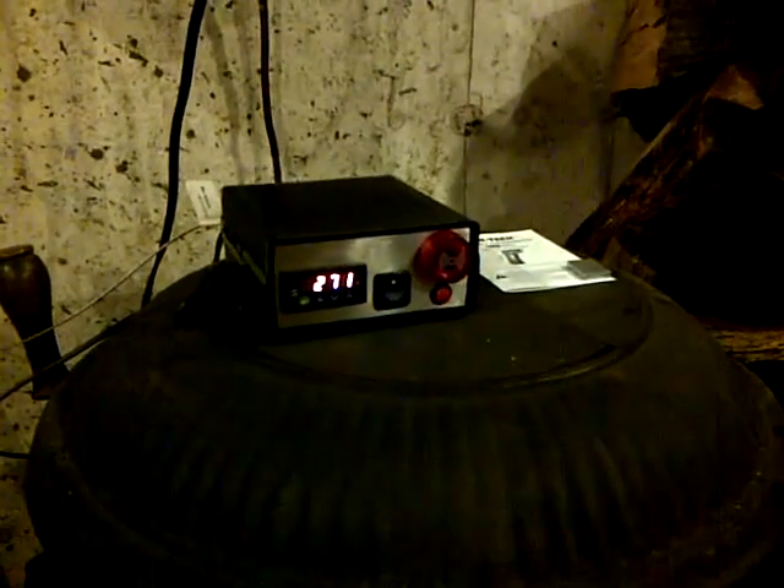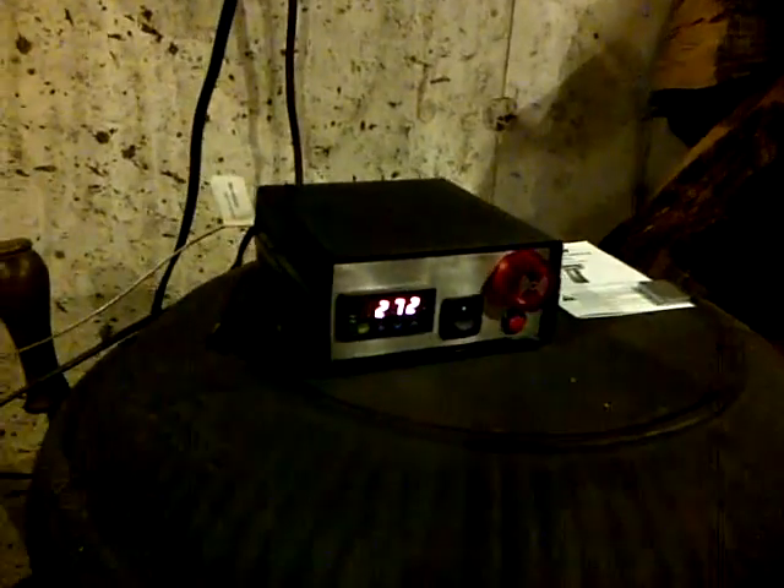It's a temperature monitor with alarm, and it's got a silver cord going out over here on the side of the unit. It's stuck on, and I have it set for 490 degrees — the alarm will buzz off and then I'll reset it. It's a nice warning indicator I can almost hear from upstairs. The side of the stove takes a little longer to heat up — that's reading 272 there. The top of the stove, right above where the combustion gases exit, is reading over 400, and the stovepipe is already reading a little over 350.